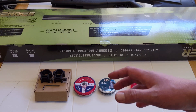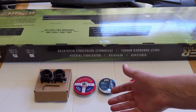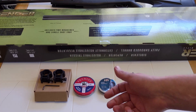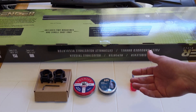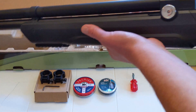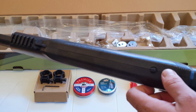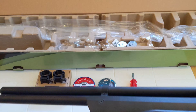From his experimentation, I concluded that you need about 100 PSI per grain of the pellet you're shooting. These pellets are 14.3 grains, but I'm also getting some H&Ns and JSBs that are 14.6 or 15.9 grains. So I'm going to set the regulator to 1500 PSI. That way the shots go straight and I also get more shots before it falls off the regulator. From the factory, it comes with roughly 1500 PSI in the tube. To adjust the regulator pressure, I need to bleed the air first or I will break the regulator.